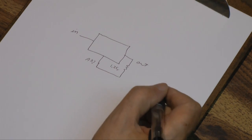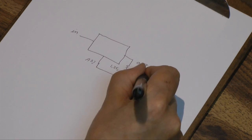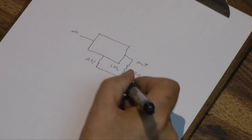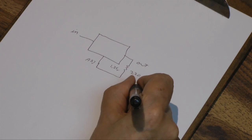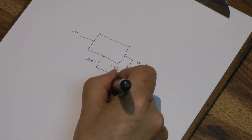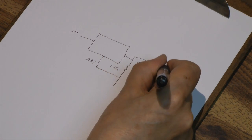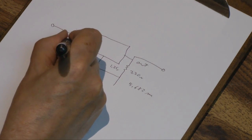The normal value of that resistor is about 220 ohms. So that means there's a current through there of — and I've already looked this up — 5.682 milliamps, or 0.005682 amps. Now that current goes this way. We have our out and in, and some capacitors.